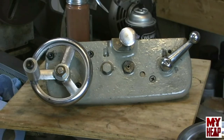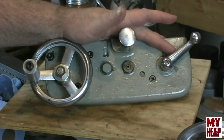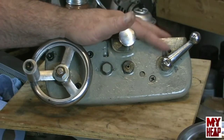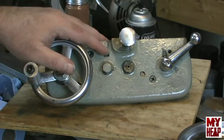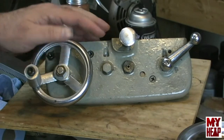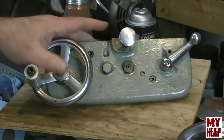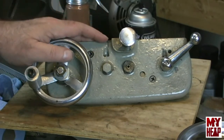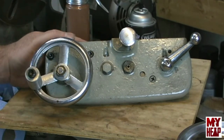Doing the stuff. A big shout out and thank you to Chris for the follow-up video that he made for me to show me different stuff on his apron, the set screw and spring length for the detent, the type of screws that he had in here, the oilers and that sort of stuff. And again, if you guys feel a need to replace your oilers, these are Gits GB ball oilers number 00520, and you can buy them from applied.com.